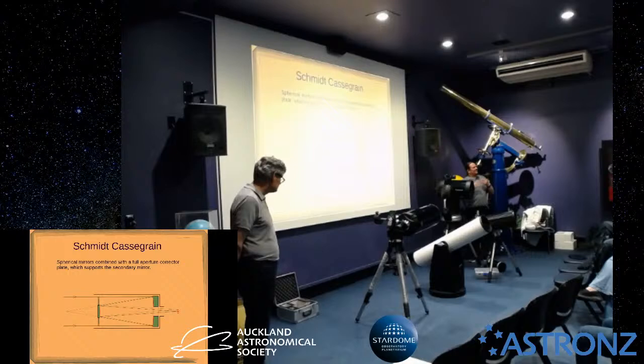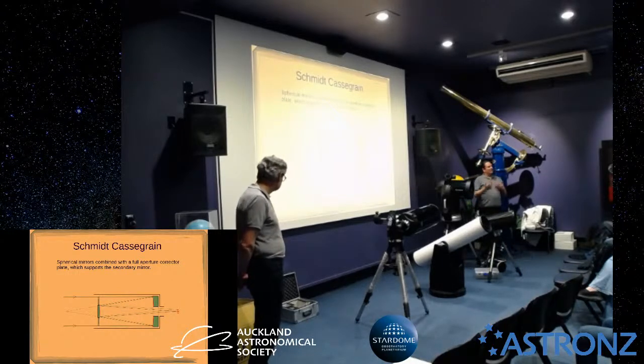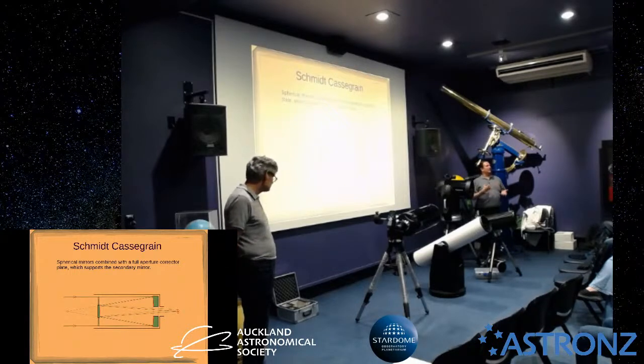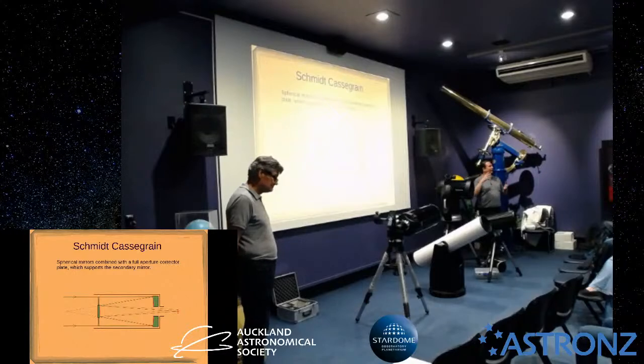Now, once you're sure that it's clean and you've got rid of the contaminants, you can probably give it just a light sort of clean, and not radially, if you see there's some spots. If you've got something that's really tricky, somebody's put their hand right on it, you've got these really horrible fingerprints, or you've got some contaminants like pollen and things like that. Pollen's a real pain, so you get pollen that lands on there and it sort of sticks. You might get mold from time to time. You might see mold spots if it's been kept damp or it's an older scope.